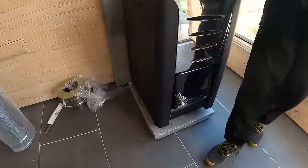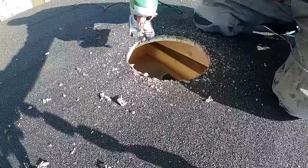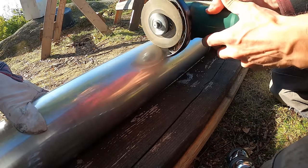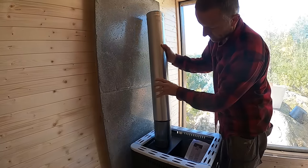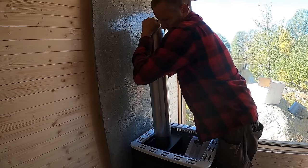Before you buy your sauna oven, you need to calculate the cubic of your room. My room is about 2 by 3 by 2, which equals 12 cubic meters. My window steals 2.2 square meters, and therefore I add these to the cubic meters, giving me around 14.2 cubic. Now I know how powerful an oven I need. I went for the Harvia Pro 20, which is supposed to support 8 to 20 cubic. It was perfect for my sauna. It's tried and tested.